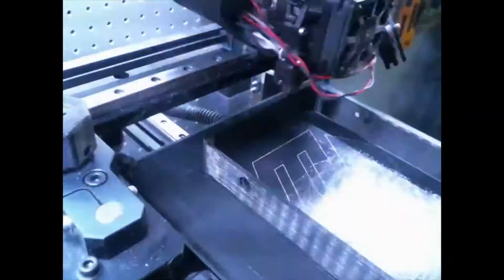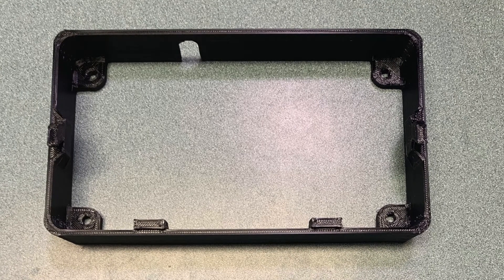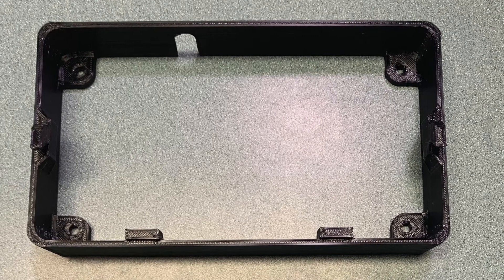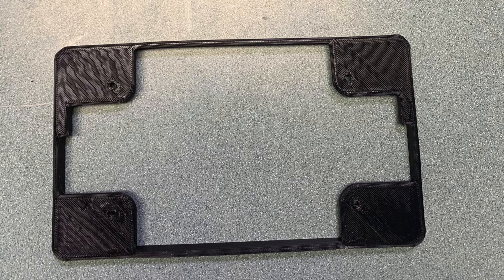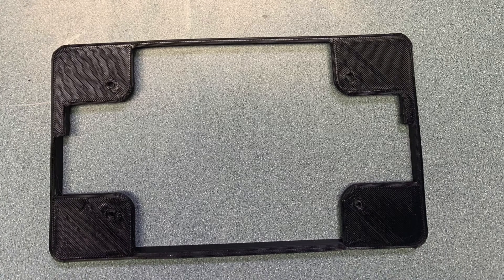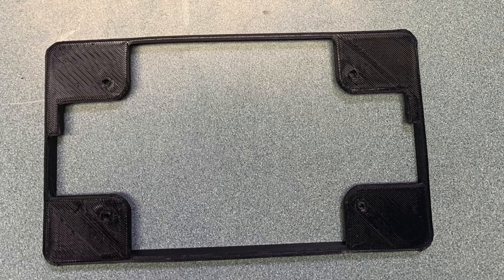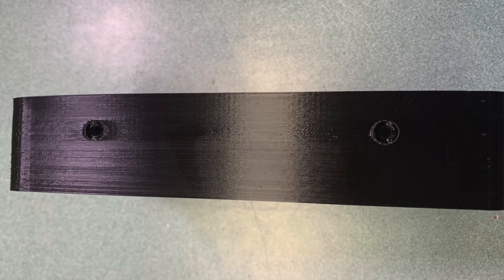What you're left with after printing is the base piece, which is going to screw into the wall — with a slot that's going to be covered up by the outer ring — and then the top piece, which is going to connect to the Raspberry Pi touchscreen and has holes already made for the mounting hardware that comes with the official Raspberry Pi touchscreen. There's also the ring piece I created, with 3 millimeter wall thickness and two countersunk screw holes on each side so that I can join it all together.